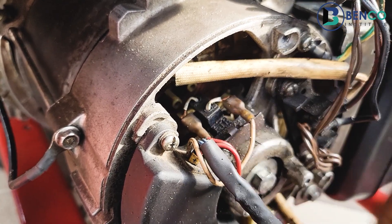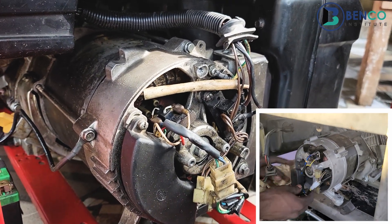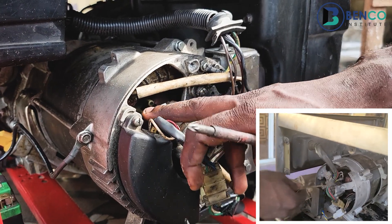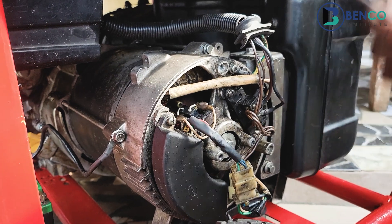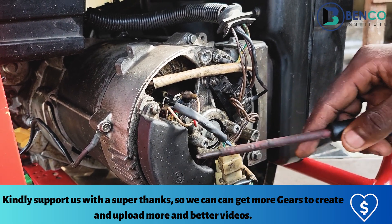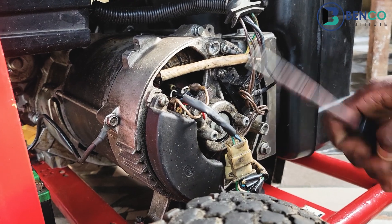There is an introduction of a particular component called the AVR — the Automatic Voltage Regulator. What this does is help in regulating the output voltage that goes into our house. What it does is transfer appropriate voltage to our house. Without the AVR, there will be a spike in voltage and it will destroy some components or household appliances. But with the AVR, it gives us a steady 220 to 240 volts. If the AVR is faulty, the generator may produce no voltage, or the voltage will be too low or too high — that is one of the signs to tell you that the AVR is faulty.